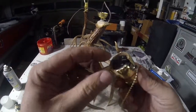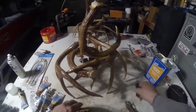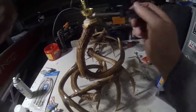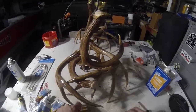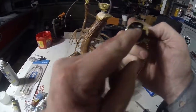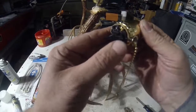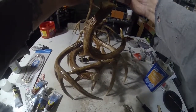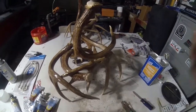Okay, for the next bit, we took the socket apart. The base just screws on. You've got to back out a little set screw right there. Thread the base on, and then lock in your set screw. Now, these are going to be some short leads. You can see the connectors are right there, and they've only got to go a little ways. So we're going to nip these down, and we're going to put some connections on it. Be right back.